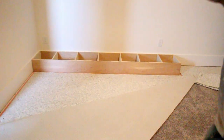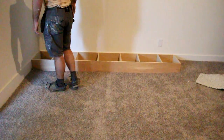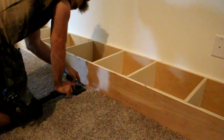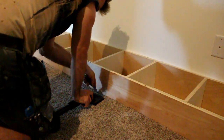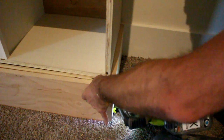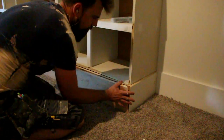Ideally, you should have roughly a quarter of an inch from the front of your tack strip to the front edge of your footer. Remember, this is a subfooter — a backing that we're going to be attaching the trim to — so it doesn't have to be a perfect fit, but you want it as close as possible. Once the footer is in, go ahead and start reinstalling the carpet. If this is a DIY job, you can rent one of the carpet kickers, which you kick with the back of your knee and it puts the carpet back in place on the tack strip by adding tension. I usually get a putty knife or scraper and push the tip down so that it goes over that tack strip and down into the quarter inch void — it kind of bunches the carpet back a little bit and that helps provide extra hold on those tack strips. In my case, the trim is going directly on the front of the piece, so I'm building it right onto it with a single miter on the corner.